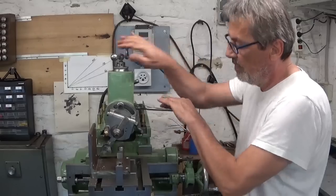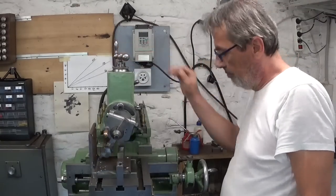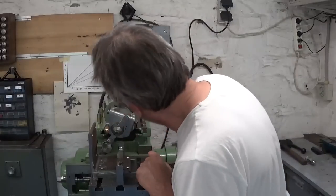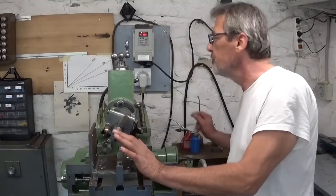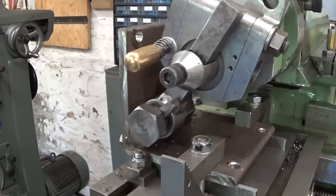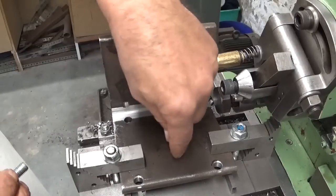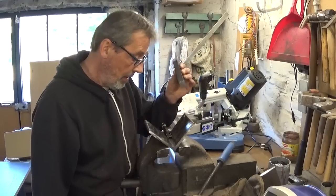Use depth of cut. I have to slow down. This doesn't work. I think I'm gonna switch tools. This radius is really too big for this little shape. The finish is far from perfect, but I think it doesn't matter because here is no finish at all. And my little bolts now fit. Time to put this reinforcement in place.